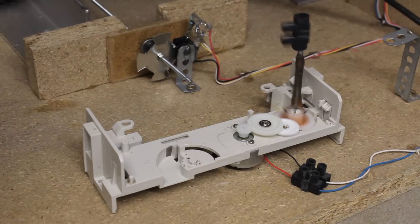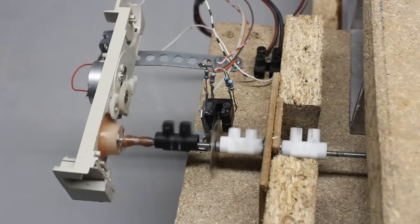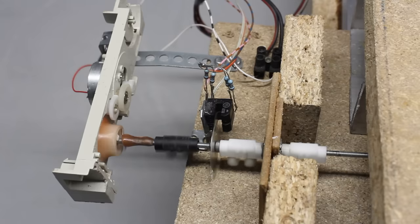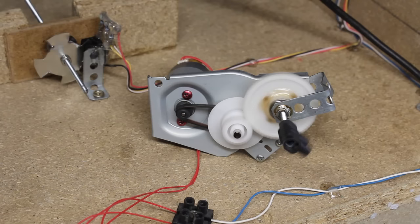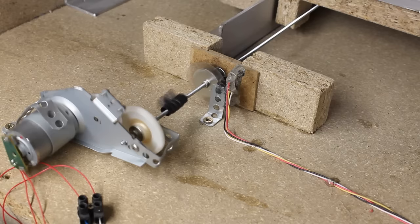Let's go back to our handmade encoders. For my CNC machines I use threaded rods to create linear movement along the axis. This geared motor is from an old optical drive — it usually opens and closes the tray. The sensor disc is attached to the threaded rod so that clearance caused by the plastic gear can be widely ignored. By the threaded rod, the rotational movement of the geared motor is turned into linear movement. This motor from an old printer is more powerful; here it's driven with 5V, and at 12V torque and motor speed increase clearly.